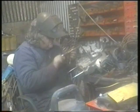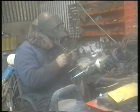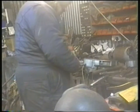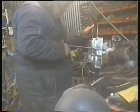It's a good idea to move the stainless rod every now and then just to make sure it isn't sticking, because as the aluminium cools it tends to contract onto the rod. Eventually you build up enough material for it to be cleaned back, and as you can see here, just tap the rod out — although it got stuck and I had to use a drift to finish it.